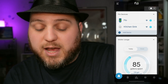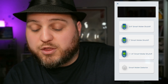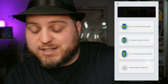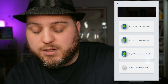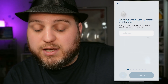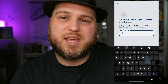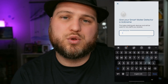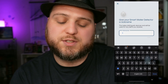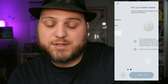We're going to start by tapping Add Device. With that selected, we have the option of four choices — three of them being the smart water shutoff valve, and one of them being the smart water detector, which is what we're using today. Click Smart Water Detector. Now we're going to go ahead and give it a nickname. I like to title this product based on where in the home it's going to be. In this case, I'm going to set it near my water heater in the basement, so I'm going to simply title this "water heater." Hit Next.